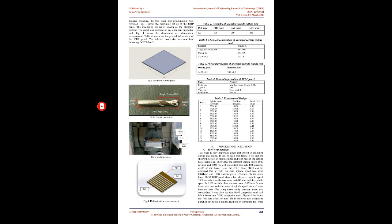2. Material and Methods. The experimental process was conducted on different compositions of the J.F.R.P. panel using a CNC machine. The fabrication was done using a hands lay-up technique. The first composite panel was made with 60% reinforcement and 40% matrix material, consisting of five alternating layers of jute fabric. The panel dimension was 200mm x 200mm x 5mm. Another panel at 70/30 was fabricated with 70% reinforcement and 30% matrix material with the same dimension. An uncoated carbide cutting tool with a diameter of 8.0 mm, overall length of 60 mm, and helix angle of 30° with two flutes were used.